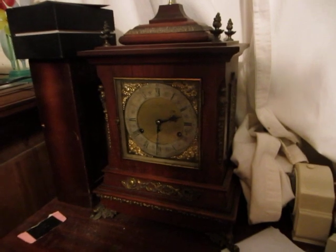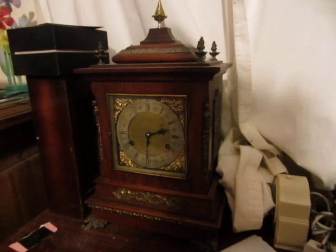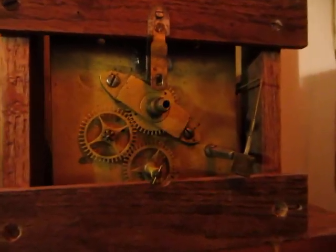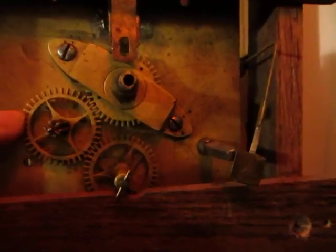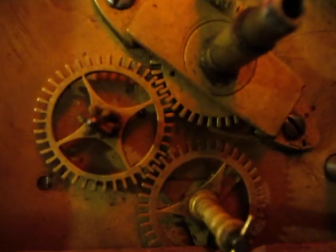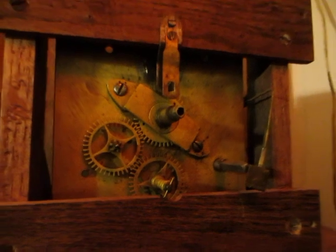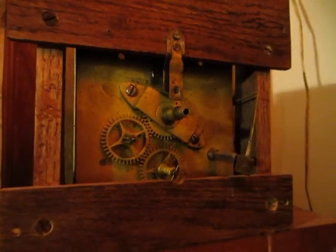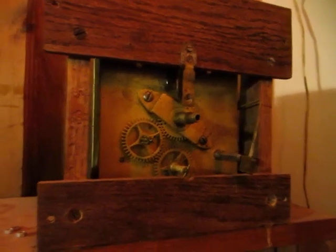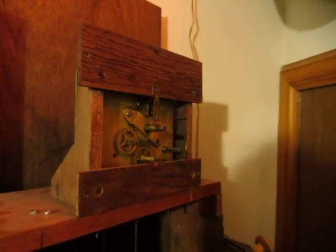Back downstairs again — I hope to have this one re-bushed and working again, but I haven't had time to get round to it yet. I hope to do this before Christmas. I also hope to make a new hour wheel for this grandfather clock. The hour wheel on it was quite thin, made with ridiculously long teeth — one of the teeth broke off. I tried to repair it but it was a non-starter, so I'm going to have to make a new 72-tooth wheel out of a disc of brass. I was hoping to have that done before I go back to work, but that will have to wait for another day.